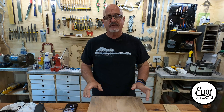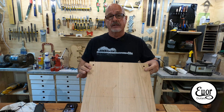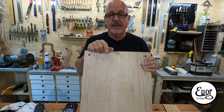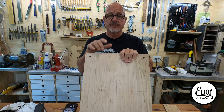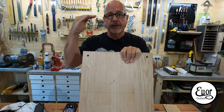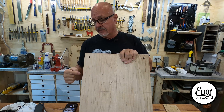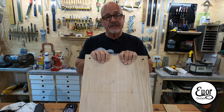What I've got to do first is go over to V-carve and update all of the G-code files to reflect the new thickness of the wood. When I created the original G-code files, I had it going into a piece of three-quarter inch MDF. Now I have to update the file with the new thickness of the wood — it should be a very simple thing to do. I'm just going to open up each file, change the thickness, probably increase the number of passes, and then we'll come back here, set up, and run it through the CNC.